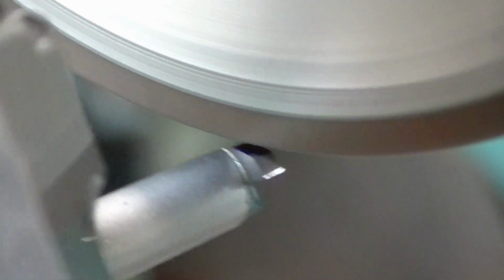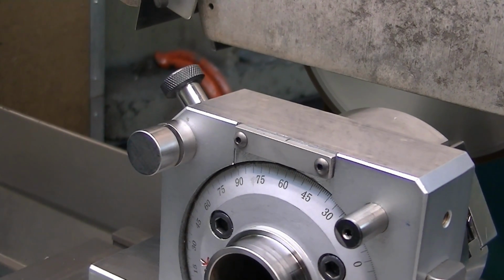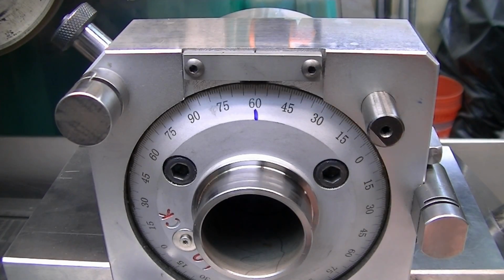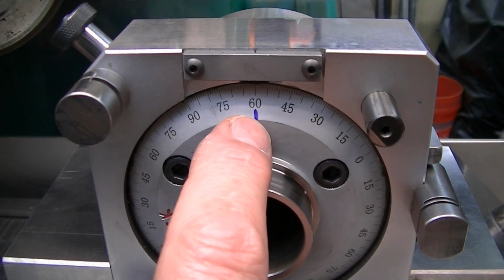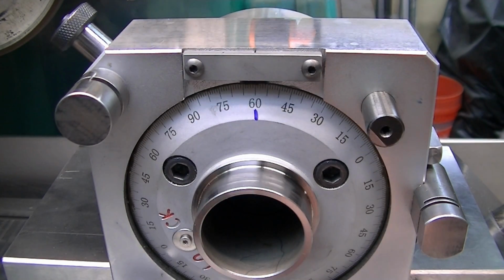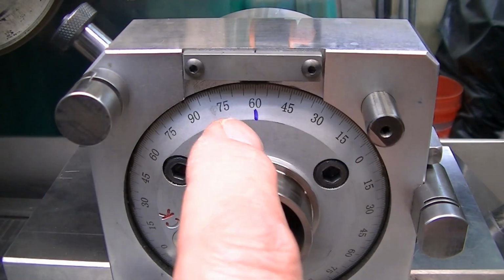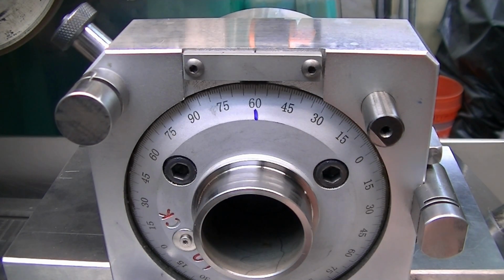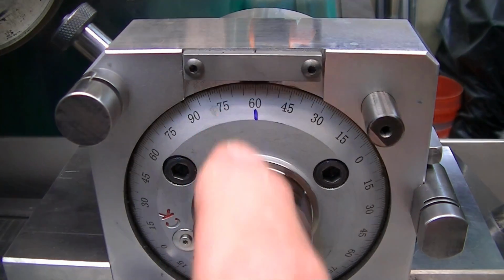This is the 30 degree facet, which is 60 degrees. There we go. Just knocked the blue off. In this case, I can just use the straight 15-degree indexing of the punch grinder to go to my 60-degree. Here I don't need the stop because I can use the straight every 15-degree indexing. But this grinder uses the 0 to 90 in 4-quadrant type of divisions, which isn't bad, but there's 4 different 60 locations on here, so it's really good to mark where you want to get back to when you're moving this thing to get to the screws that hold the part back and forth every part. Make sure you mark it.